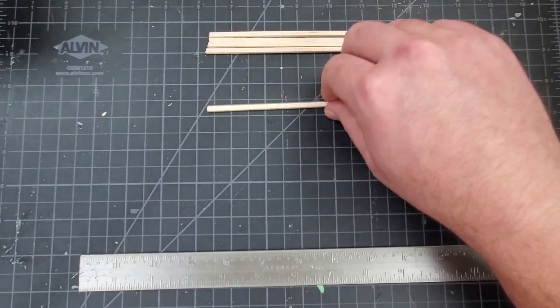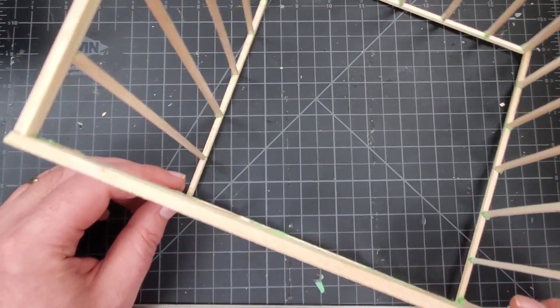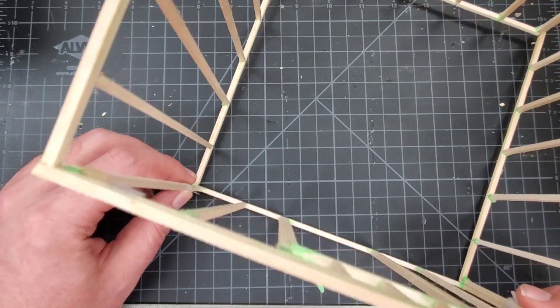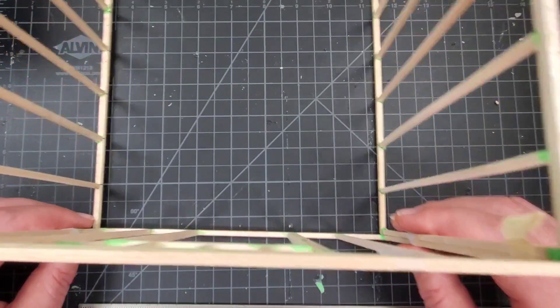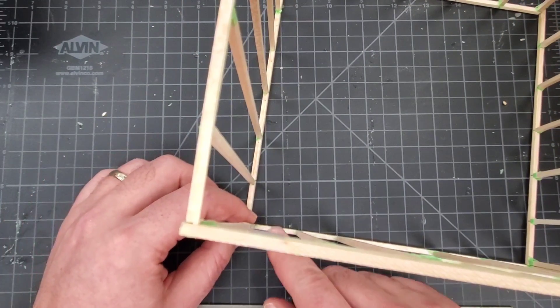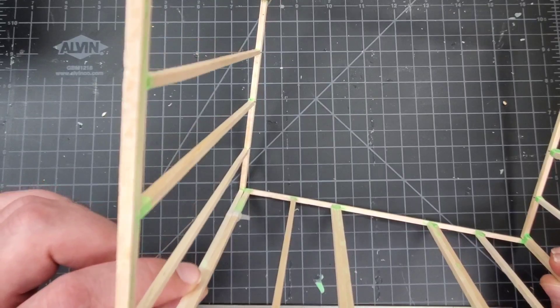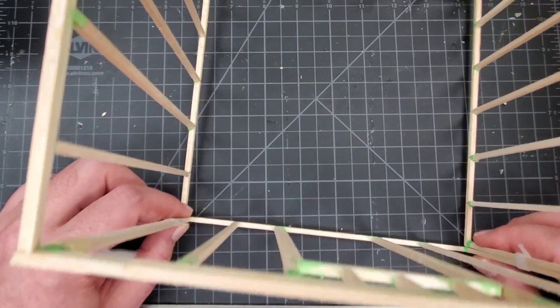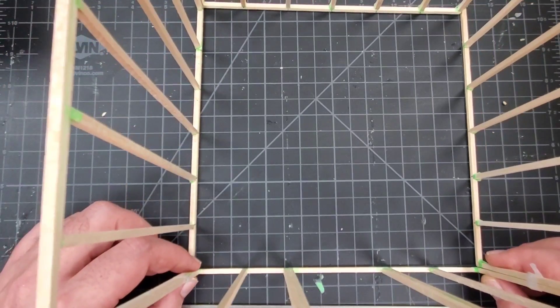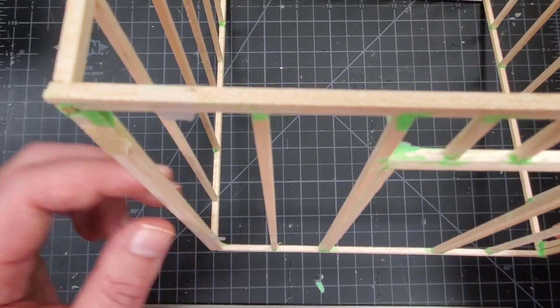To start off, we're going to move all this to the side and begin with our bracing. Bringing in our shed, you can see we have our offsets — this wall is on the outside edge and this wall is on the inside edge of the corner. We're going to start with the front side and place the bracing on the inside edge of all four walls, which is going to give us a nice strong shed.